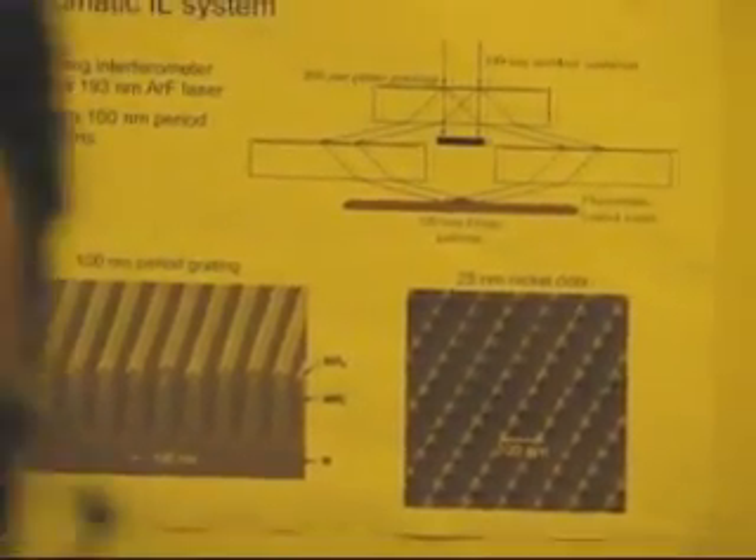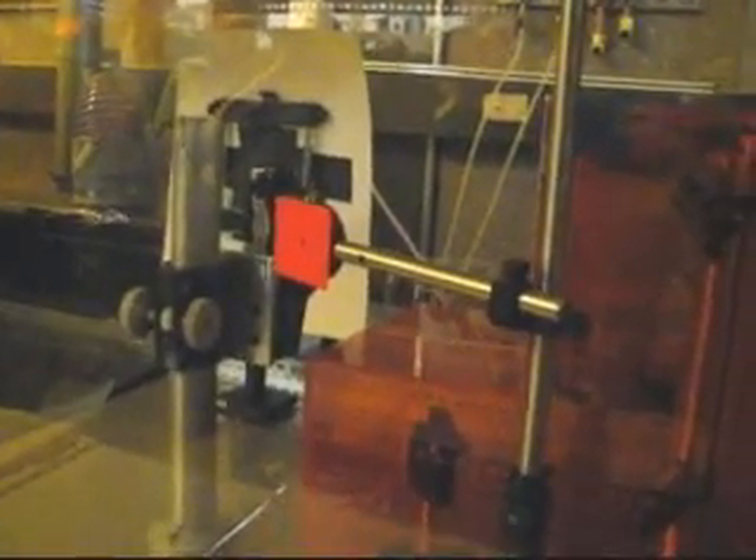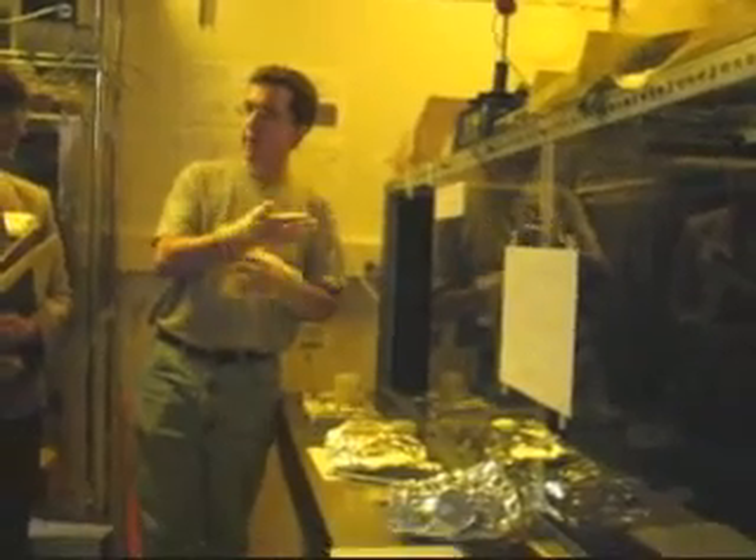The basic setup here is on the back of the table is a helium-cadmium laser, 325 nanometers. That bounces around a few times up to a spatial filter that basically focuses the beam onto a pinhole, so that you remove any aberrations from the lens or from any of the optics. So what you end up having down here are very nice high-quality spherical waves.